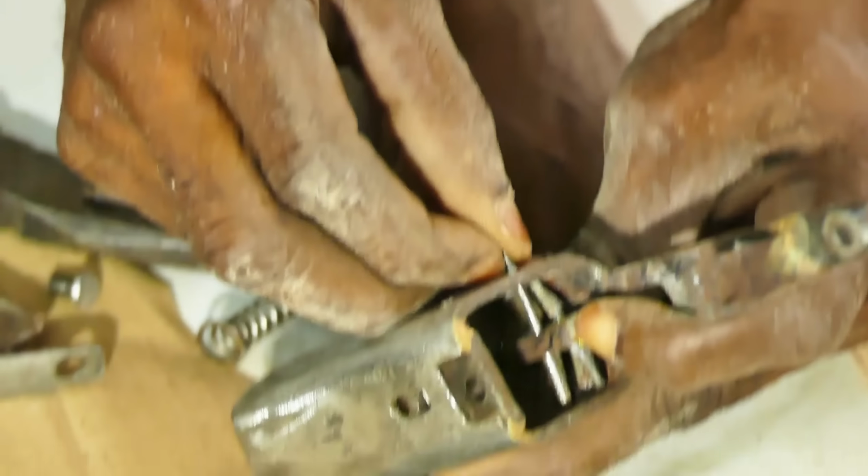Anyhow, the shotgun was returned to the gunsmith and he was able to increase the strength of the firing spring. He inserted a better firing pin, centered everything properly, and generally improved the working of the gun. He also did the varnishing of the body and also the bluing of the steel that he had used and the barrel.